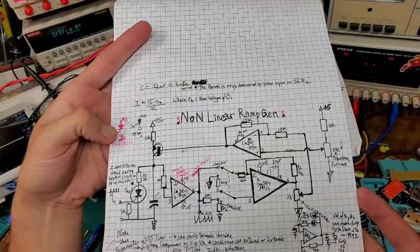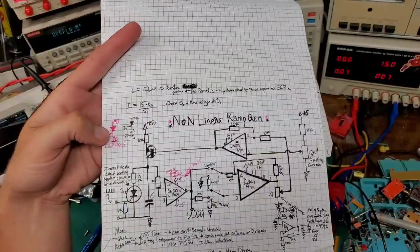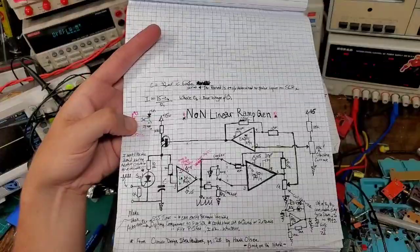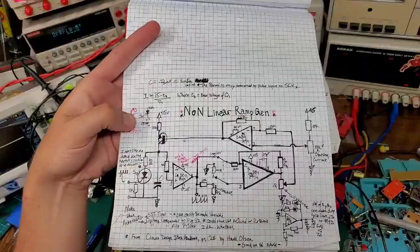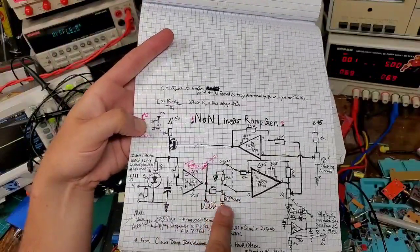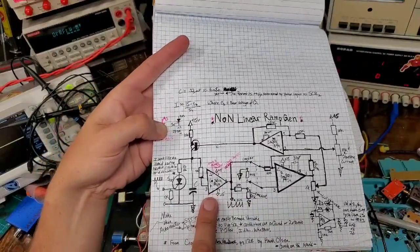Okay, here we go. This is it. It came from the Circuit Design Idea Handbook, page 128, by Hank Olson. Good on you, Hank. In that, he basically states you can make it convex or concave, no matter what you want. In this, we just wanted a concave, so I did away with the switch, just had those permanently connected, so 3 is going from the voltage divider of the first amplifier, which is an LM310, don't need to look it up, it's just a buffer amp.